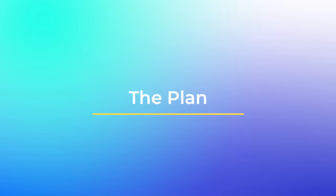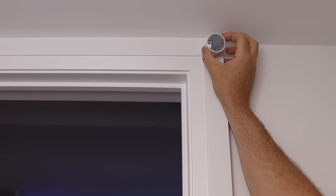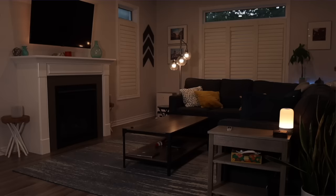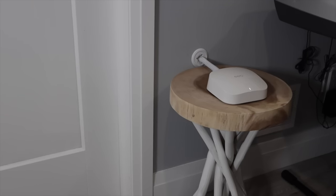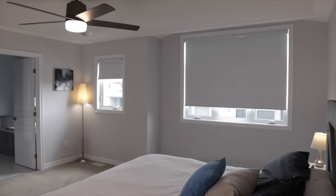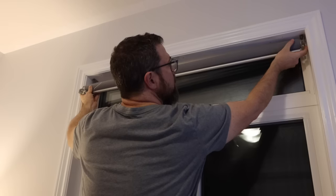Do you just want to add some lights that turn on when you enter a room? That's something you can get started with just a smart switch and a motion sensor. Or maybe you have a plan to make all of the lights in your house smart so you can turn them all on or off with a single click or a Siri command. With something like that, it could take a while depending on the number of lights you have. You'll need to consider where to use smart bulbs, where to use smart switches, and whether you want to use WiFi — which I wouldn't recommend if you have a lot of switches unless you've got the router to support it. If you want to add smart blinds, which I can tell you is life-changing, then be prepared because that can be expensive as well. You'll need to decide whether to retrofit or install new blinds, what technology to use, and what brand to choose.